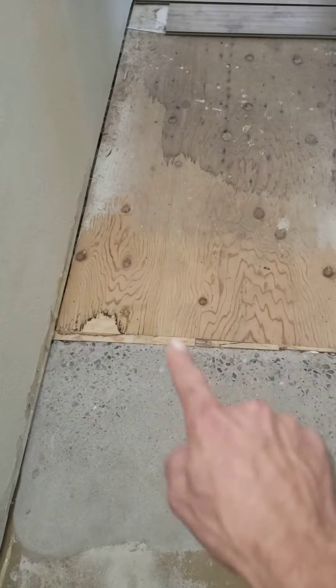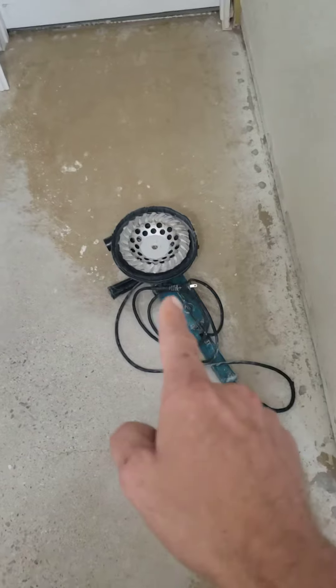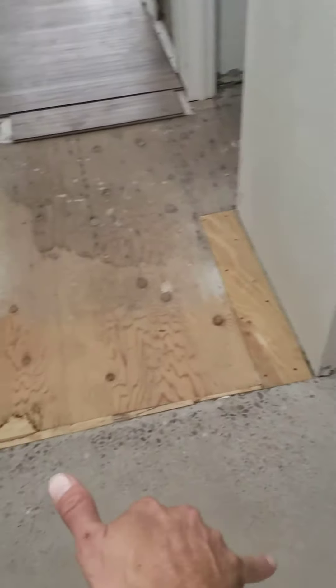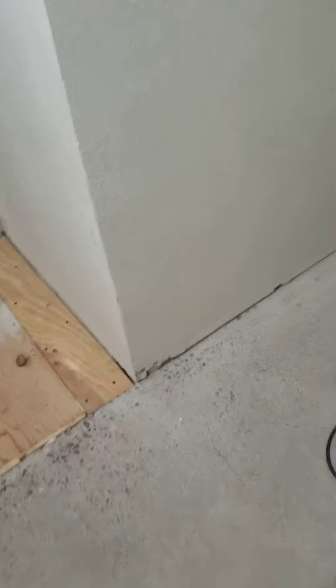This was the hard part — it was belt sanded. The key tool was a two-foot level. You lay it on the surface and just keep rocking it back and forth, looking for your high spots. That's how you dial it in. But most importantly was the setup: plastic sheeting in this area and a towel under the door.